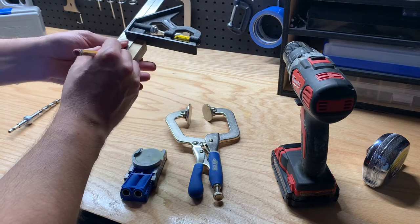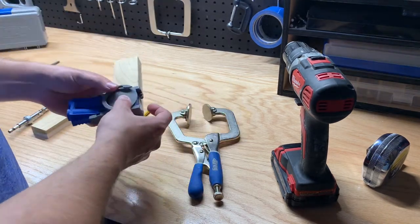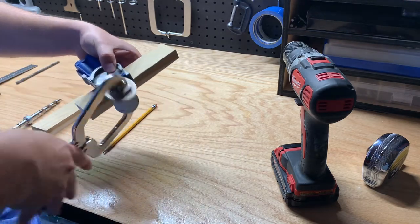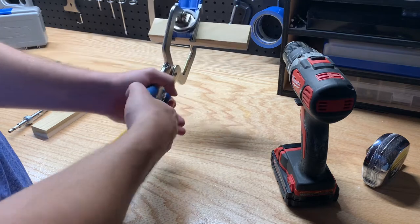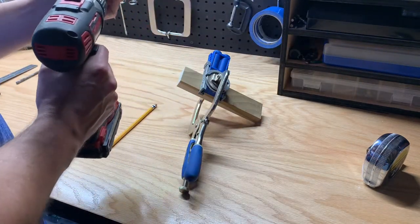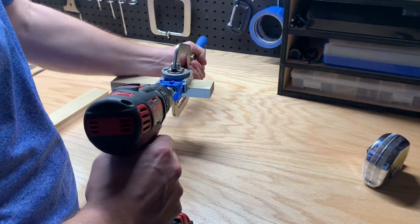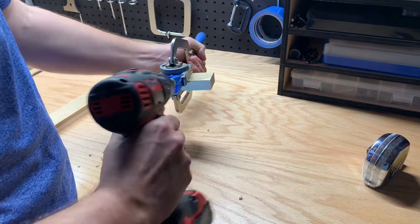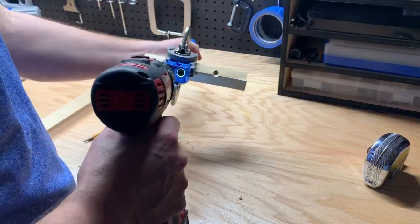This doesn't have to be perfect, however I had a combination square set at two inches that made it easy to transfer measurements. Align the line on the jig with the line marked on the legs and clamp down the jig flush against the material. Adjust the clamp to have a tight clamp when drilling. Ensure the stop collar on the drill bit is set at the three-quarter inch mark, using the guide on the inside of the Kreg jig case to align with the material thickness. Drill each hole until the stop collar on the bit hits the jig.